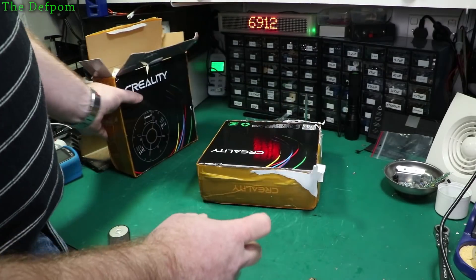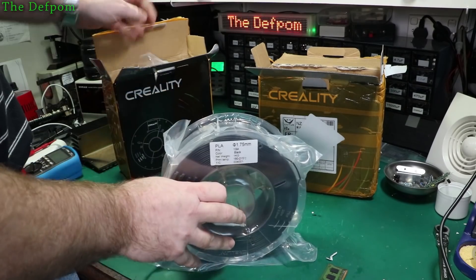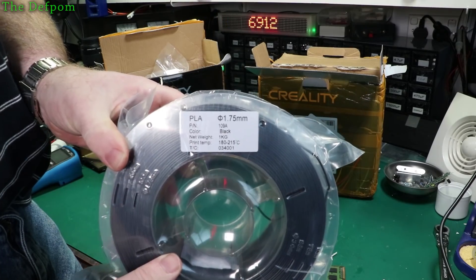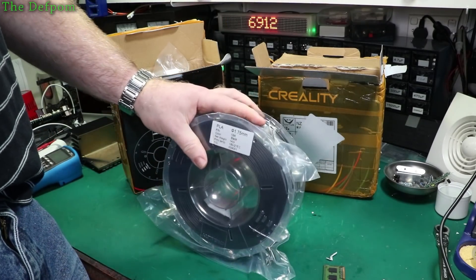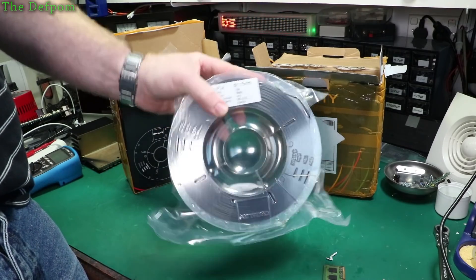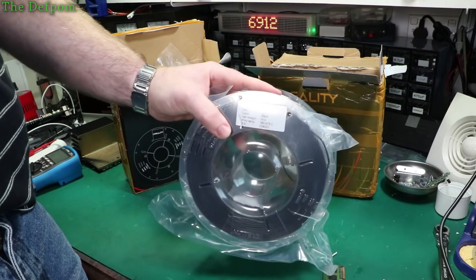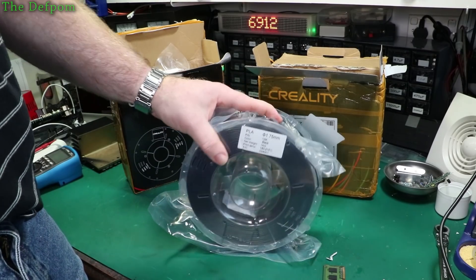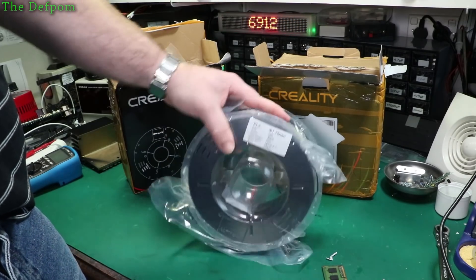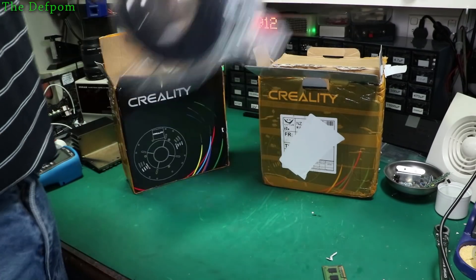This one should be a black one. It's got the same details: 180 to 215 degrees C, same as the white one. So it's got a lower melt temperature than my existing PLA which is stated as 190 to 230. What that means is that this will have a lower molecular weight, a shorter chain length of molecules, making it flow easier. Or it's got some additives which make it easier to flow — probably a bit of both. Anyone who knows about plastics materials will know what I'm talking about.